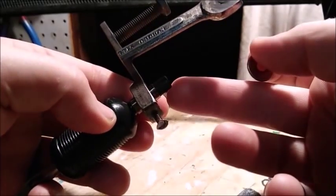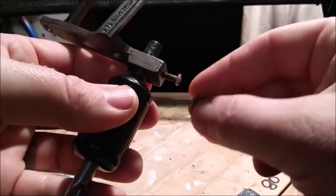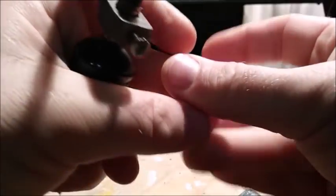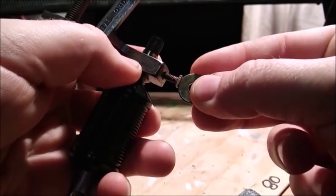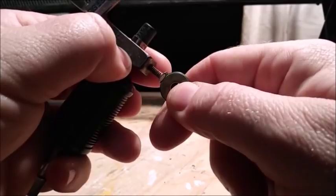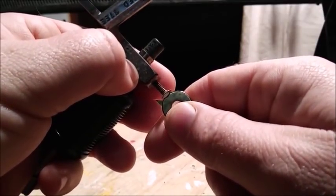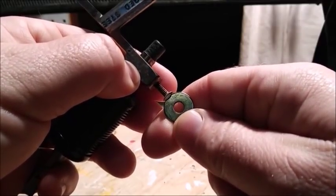We have the screw right here that will put pressure on our tube, holding it in place, but we need to be able to tighten this down. So you never want to just have the screw head here. You want to have something big enough that you can grab with your fingers, something big enough that's comfortable to turn with your fingers here that won't hurt. And what we're going to do is use some brazing techniques to make this into one piece.